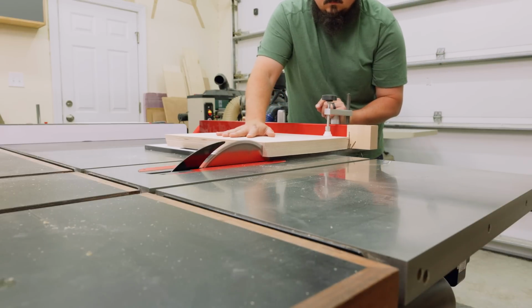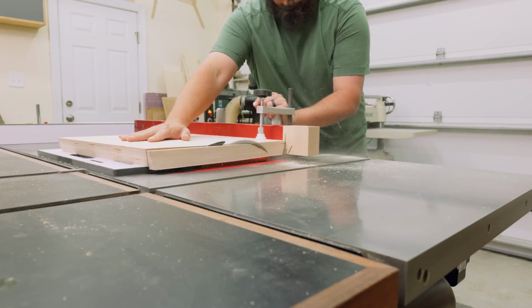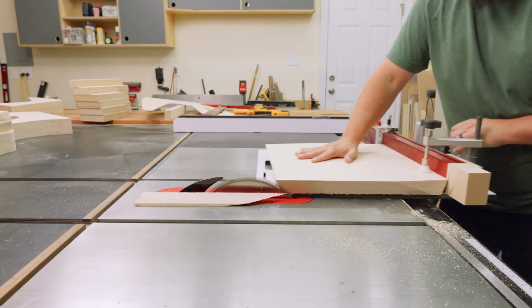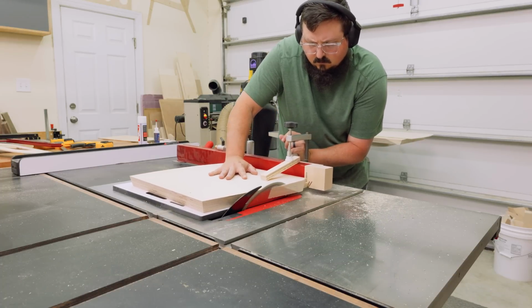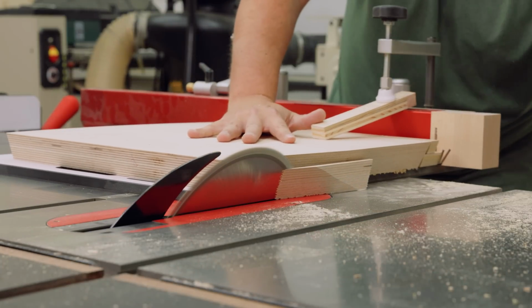So I decided to angle the back both 20 degrees and at 86.5 degrees. This in itself created some challenges because I had to create a wedge that was 3.5 degrees to cut the opposing angles. And this is because the table saw blade only tilts one way. If I try to flip the sled and cut it on the other side of the blade, the seat ends up running into the blade and alignment becomes kind of messy.